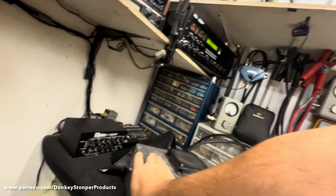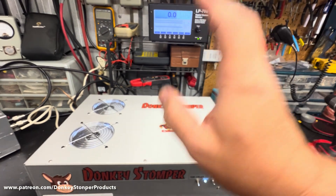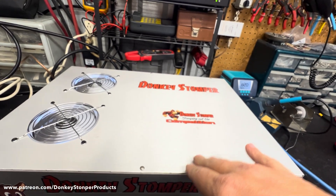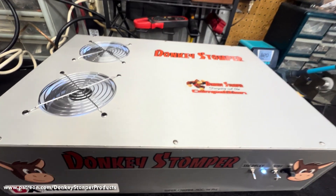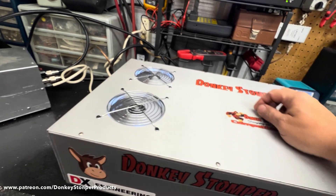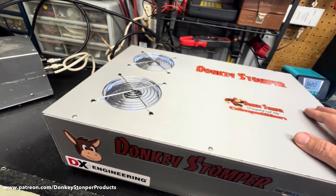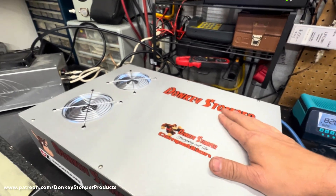I'm going to turn that off and turn on the old super baby because remember - we're running Cs, and people don't realize this: 2879 Cs will do more PEP if you drive them harder. But if you're going to have a lower drive, regular HGs will beat them. Regular HGs have more dB gain than the Cs. But when you sock the drive to the Cs, they come on and outrun the HGs. So if you've got low drive, you're better off with regular HGs. I've changed the Cs three or four times - these are 22 dB, started at 18, the last one I bought was 23 dB. There's still development going on with the Cs.